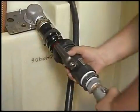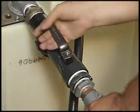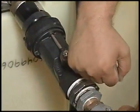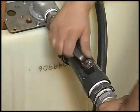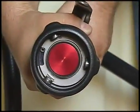The coupler attaches to the adapter and with a rotation of 15 degrees, locks in place. The lever can now be activated and liquid flows into the tank. At disconnect, no liquid is trapped between the poppets and a dry disconnect is achieved.